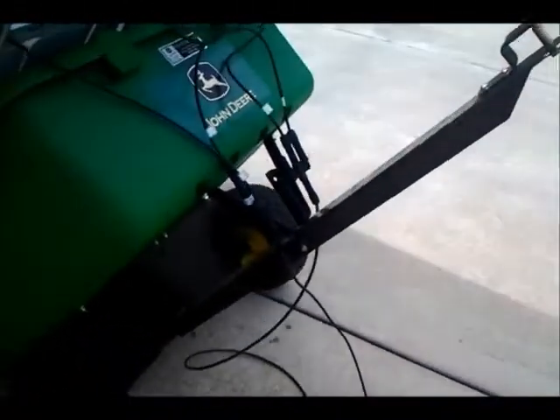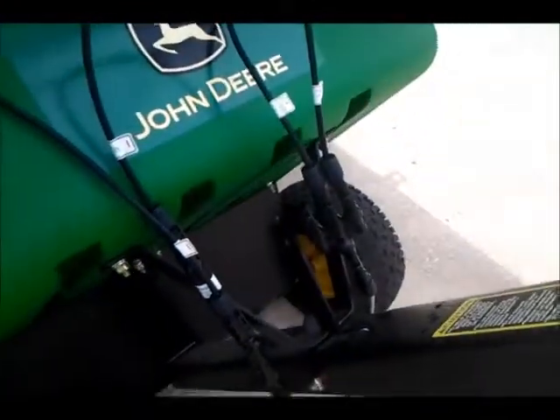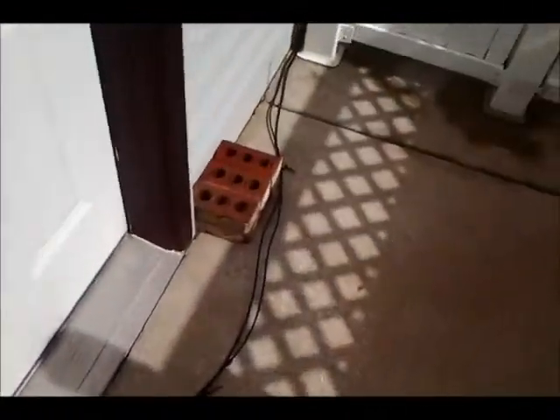Number 10 wire coming from them. I have a 30 amp fuse on one of them — the other one I've got to put on. Got them hooked in parallel. Number 10 wire temporarily hooked with just electrical connections, temporary to number 8 wire, going to the outlet box on the side of my house. So far, so good.